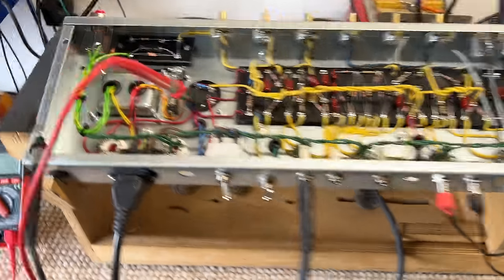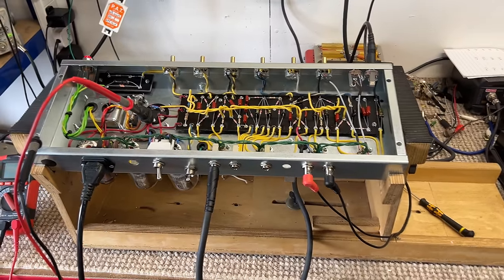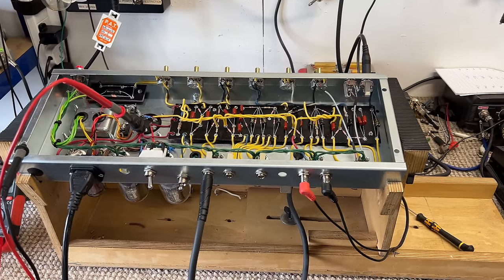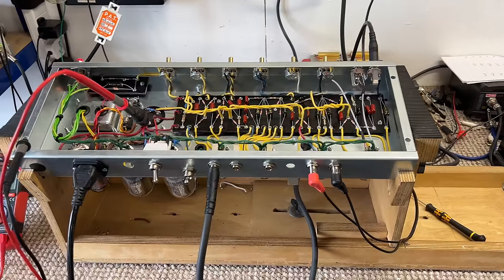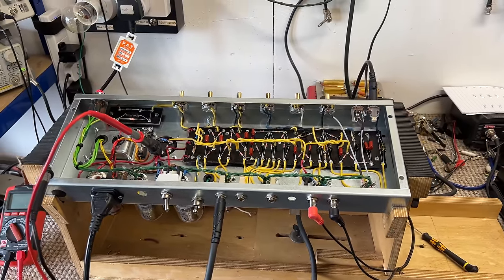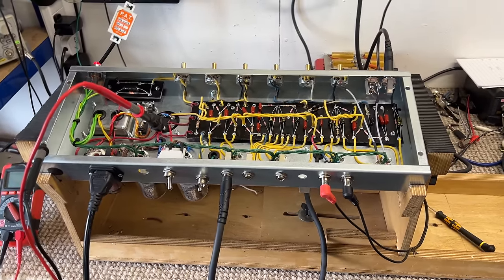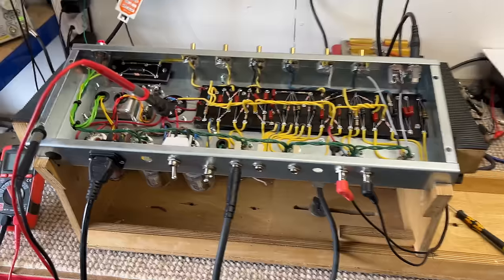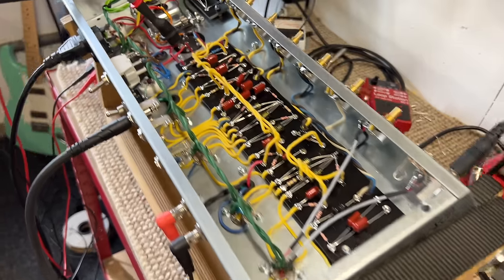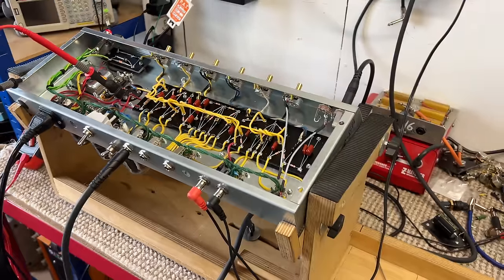Looking good. I like to give them at least 24 hours running over the course of a week or so — get it on and off the bench, heat cycle it a few times. The cabinet is here, but I messed up and ordered the wrong impedance speaker, so I've got a new speaker on its way. When that arrives I can get the whole thing assembled and shipped off to Coda Music. PR35 black panel on the bench, running sweet.